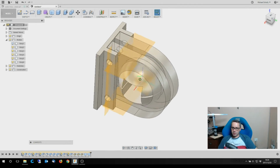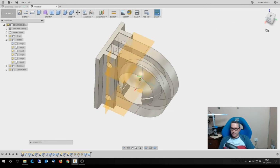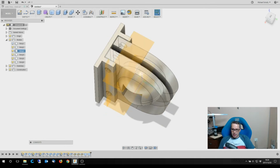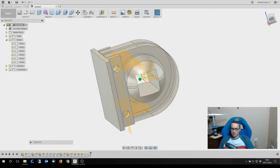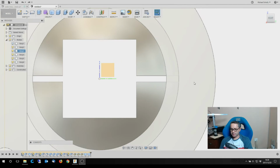And what that's going to do is actually allow me to just put an 8 millimeter shaft through there. And because of all the 3D printing stuff, 8 millimeter shafts is something I've got quite a bit of. So that's the reason I made that size. I'm just going to put that through, and that'll allow these middle sections just to float and sit where they need to be. Right, so what's left is to put those holes in.